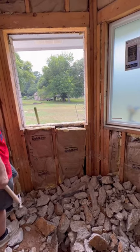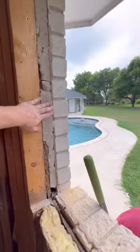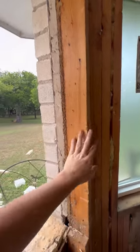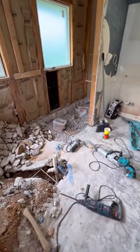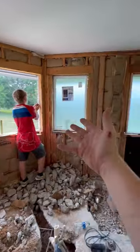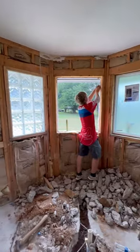We'll put that in after. We'll put blocks in between there. Yes, sir. When you go ahead and get a chisel in here and start chiseling all this old caulk line off here, so then when we caulk in the new windows — chisel in here. The reason there is rock everywhere is because we're chipping down the slab. We had to grind them down the slab from where there was tile. What better opportunity to do it when there are two holes in the side of the building to let all the dust out instead of all over the customer's house. So we're kind of multitasking today.